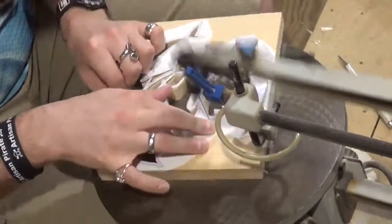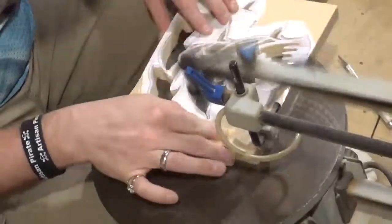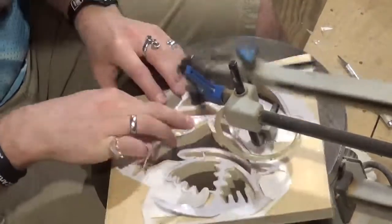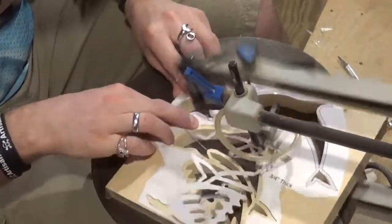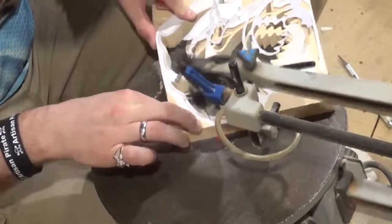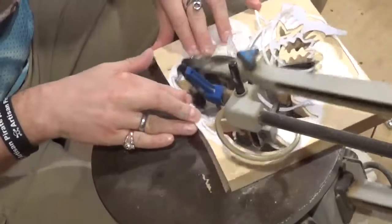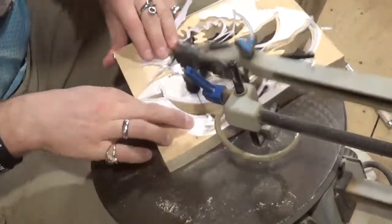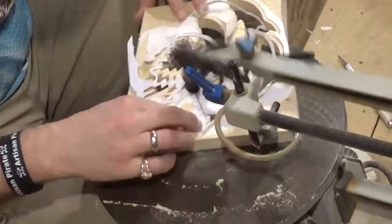Right here you're going to see the drawback of using clear packing tape to attach scroll saw patterns — I've got a fan blowing on me, it was real hot out in the shop, and you can see it blowing the pattern around. You can use spray adhesive if you want to attach your scroll saw patterns. I just like using the clear packing tape for easier cleanup and it's quicker to get the pattern off and move on to the next step. I'm used to the fan blowing the pattern around by now.